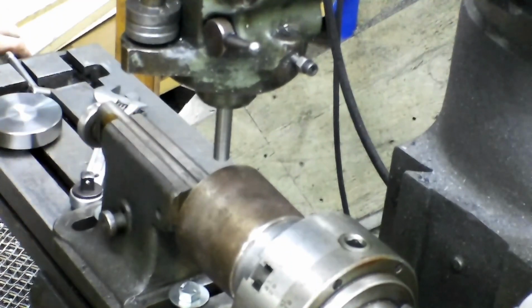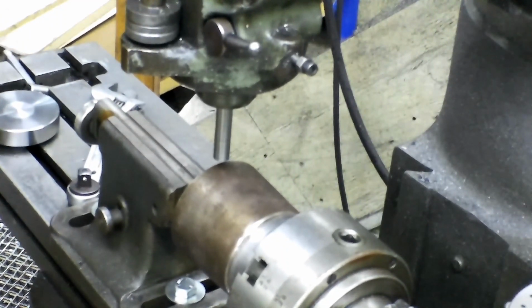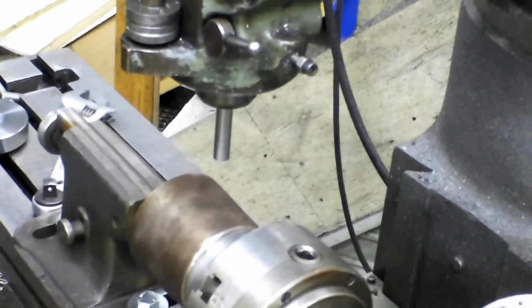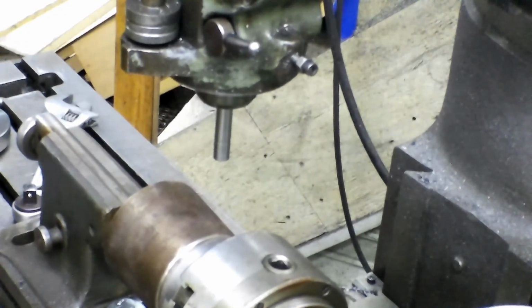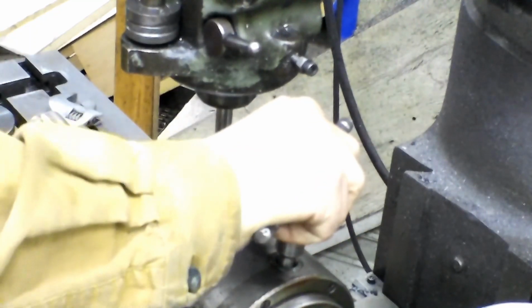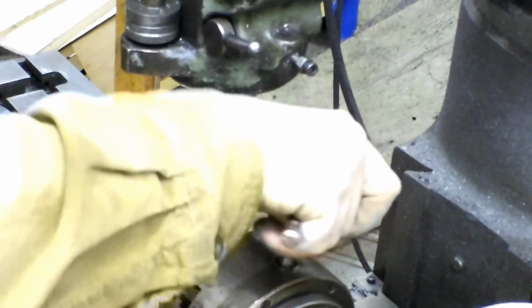And this is a 1/2 inch indicator, so we turn it 250/1000ths. And then re-zero. And then we come over here. And this is where it's going to get a little tricky. In fact, what I'm going to do here to find my center is I'm actually going to put my round stock back in there. And we're going to utilize that round stock to find our center.